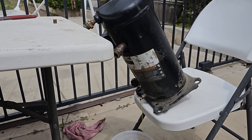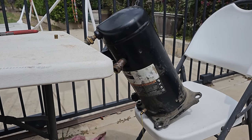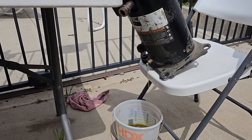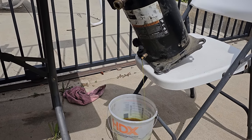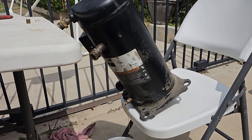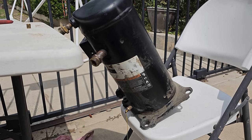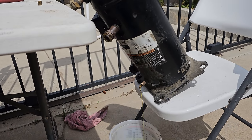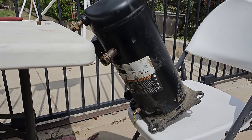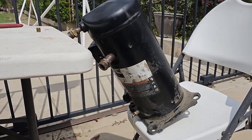Currently getting ready to cut this compressor open. Had a couple technicians out to a location and this guy was pulling locked rotor amps. Had three phase going to it and it wouldn't run. I'm draining out the oil right now. This particular customer isn't doing routine maintenance. It's kind of sad because this compressor is only from 2019 — I actually made a video installing it; it was a late night beer walk-in service call. But I'm going to open it up and see what makes this guy tick and see if I can figure out why it went bad. I already have some ideas but I won't reveal them yet.